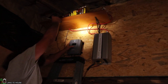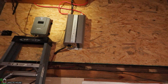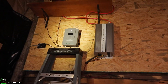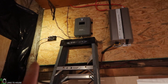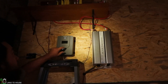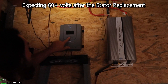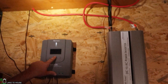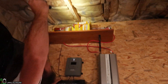So here's his electronics setup. He's got a 5000-watt power inverter right here, and then he's got the Renogy charge controller up here. You can see the rectifier is right here bringing the power in from the turbine. Right now it's charging at 27 to 27.5 volts and 0.3 amps, and the batteries are at 25.1 volts. He's got his lithium ion batteries up here at the very top — the SPI batteries.